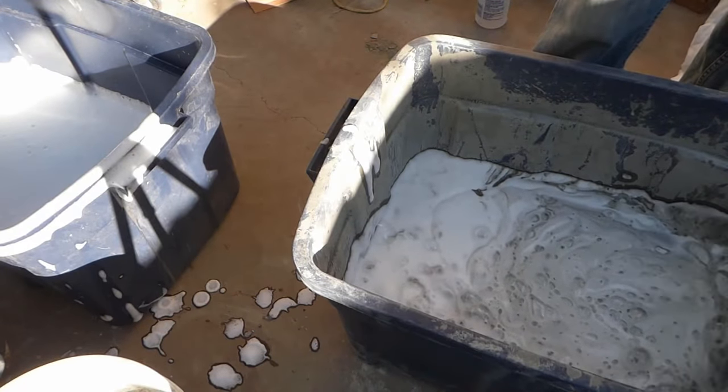All right, so I think we filled it in reasonably well all of the way across. Now what I'll do is I'll set up a cover on this, and I'm going to put a heater underneath it because it gets just cool enough at night that it takes a little too long to harden and it might collapse. This stuff is a little bit like working with a souffle. If you don't cook it right, it'll collapse and you end up with a chunk of weak concrete and no air in it, which doesn't do us any good.